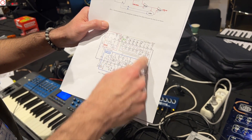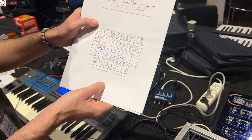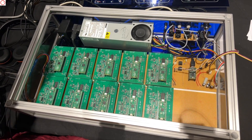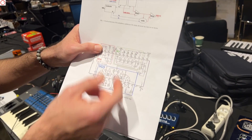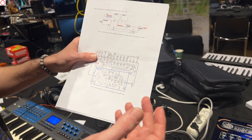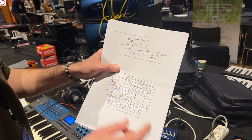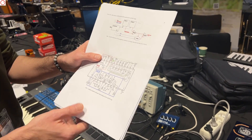What's nice about this chip is that you can put an external input. Since the microcontroller has two cores, we've used the second core to generate a numeric signal that is plugged in here, so we have a numeric signal going through the analog filter. This opens a lot of possibilities to adapt the code for every type of synthesis — it could be FM, and right now we're using it to synthesize white noise that we can inject. How many voices does this initial open-source project have?